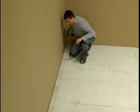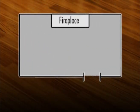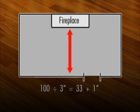The measurement will vary depending upon the board width, the expansion space, and the actual size of the room. If the wall opposite your starting wall has a focal point, such as a picture window or fireplace, measure the distance from your starting line to the focal point and divide the measurement by the width of your boards. For example, if the measurement is 100 inches and your board width is 3 inches, dividing by three equals 33 full width rows with one inch left over. If this leftover space would create an unsightly appearance at a focal point, adjust your starting line to correct the situation.